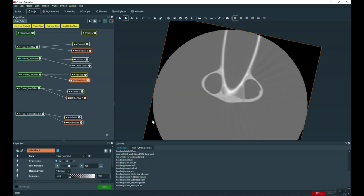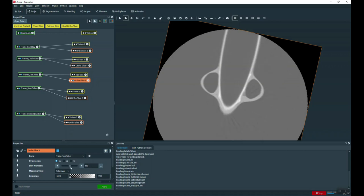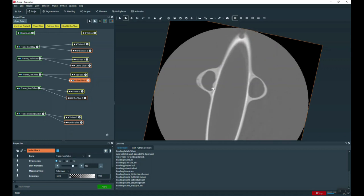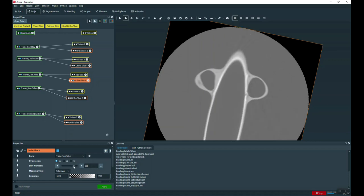So this is now the back which is coming in, and what is interesting is where the tubes meet each other. So these regions are very important for a stable frame. These look actually quite nicely. I don't see any major voids in this region. Here I would say the carbon layup is also not very optimal. So here the tube shape is quite round. Here probably the air pressure wasn't optimal in this tube, so what you can see here is a clear boundary, a clear layer, whereas here the layer is thicker, probably the same amount of material, that's why you have some air in between, that's why the layer is thicker, and also here are some voids everywhere. So not an optimal quality, I would say.